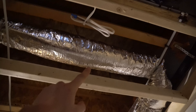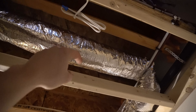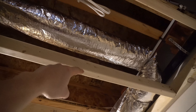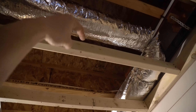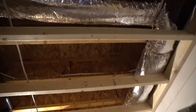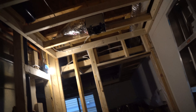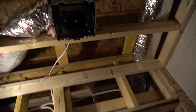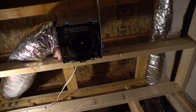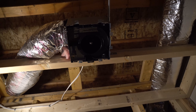If you end up doing the light way, all you have to do is take out the light, look in the box, and try to pop a wire out through the side of the box. If the box is mounted to a stud, you just drill through the box and through the stud, and shoot a piece of Romex over into your fan. I hope that helped you out with installing your bathroom fan today. This fan is extremely quiet — I'm very, very happy with it. Thanks again for watching, press like if it helped you out, and subscribe for more.